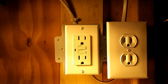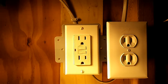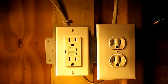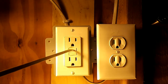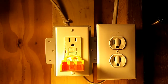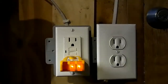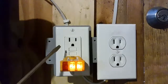First we've got to go turn on the circuit. The circuit is now on. So on the outlet, you've got a test button and a reset button — you reset it and then test it. I've got a little tester here from Home Depot, but you don't necessarily need it; you can use a lamp or a radio. I'll turn off the lights so you can see the tester. The two orange lights on the tester let me know the outlet is working properly.